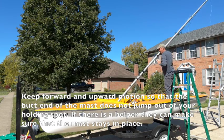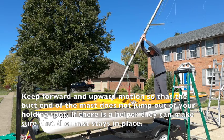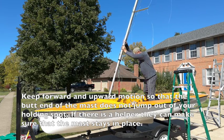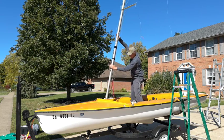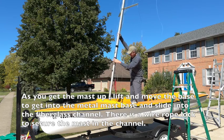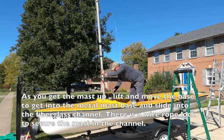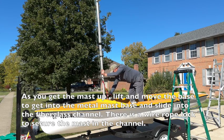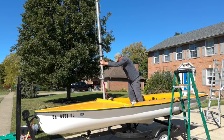Now I'm kind of pushing into the front of the boat and lifting so that the butt doesn't kick up, because it's kind of top heavy. Then I've got to step over the traveler, which is always a challenge. Now gonna lift a little bit, keeping that upper hand to control it. We're going to get it into that fiberglass slot, get the lines out of the way. It's also in the mast base, and then there's a little wire rope that'll lock it in there because the boat is leaning forward slightly — it keeps the mast forward.